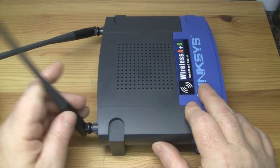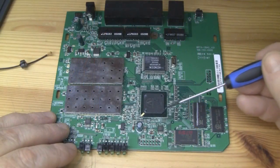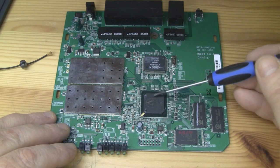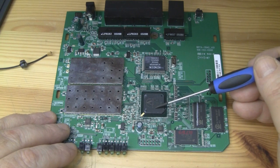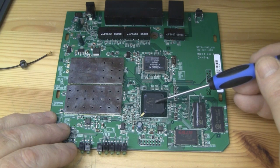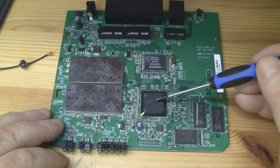Although it keeps the same form factor as the classic Linksys routers, these antennas are fixed, so I'm going to have to change those out and put some SMA connectors on the back. I've got the main motherboard out of the router now, and this here is the chip that gets extremely hot — it's an Atheros chipset. This is the version 2 of this router; version 2 will not run OpenWRT or anything like that, but I believe version 1 did, so if you want one I'd track down version 1.